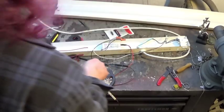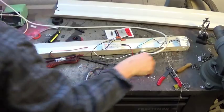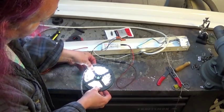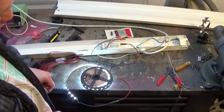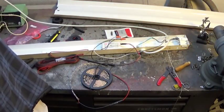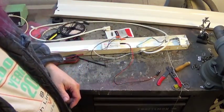We can test and make sure this is actually going to work. Plug in our fixture and turn it on — and here we have a section of LEDs that are not lighting up. Half of the strip is working, the other half is not. Let's see what happens when we plug into the other plug. The other portion lit up, so somewhere we have a break in the strip and we're going to have to go find that. But for the most part, the power module is working and doing what we want — that is actually the heart of this project. I'm going to solder and heat shrink my wires to make sure they have a good permanent connection. I'll turn the camera off so I don't bore you with that operation.